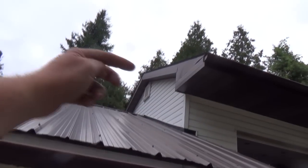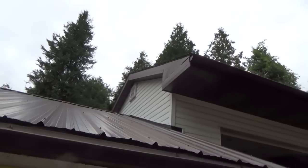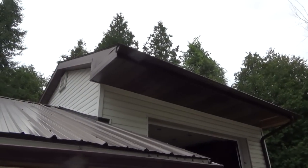He's like, yeah, sometimes it happens if they put too many vents in, which there's not too many vents in here, but there's the end, like a gable vent there, and then there's, whatever you call that, at the very top vent, which vents out there, and then there's these soffit vents here on each side. He says, well, what'll happen is the air will actually come through and out your vent, and it actually sucks out, which will suck moisture, snow. He says, I've seen snow in people's roofs before because it did that.